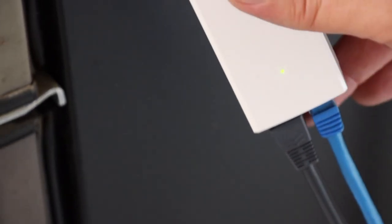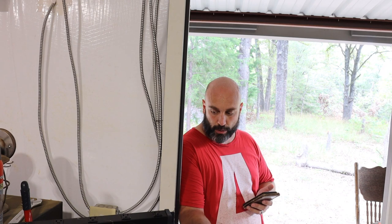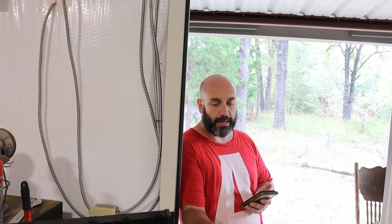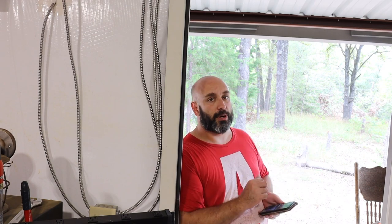It looks like we're powered on on the antenna. On the other side you should see three lights lit up. The black cable coming in is our power over ethernet to the antenna and the blue cable is the LAN side — that's going to go to our access point. You can see the light on the access point is white now — it was red when it was booting up, which scared me for a second. The power over ethernet box has the blue cord going into the LAN, which goes to the access point into the WAN side. Everything's working, I've got great signal. We just need to drill through the wall wherever we want and clean it up.